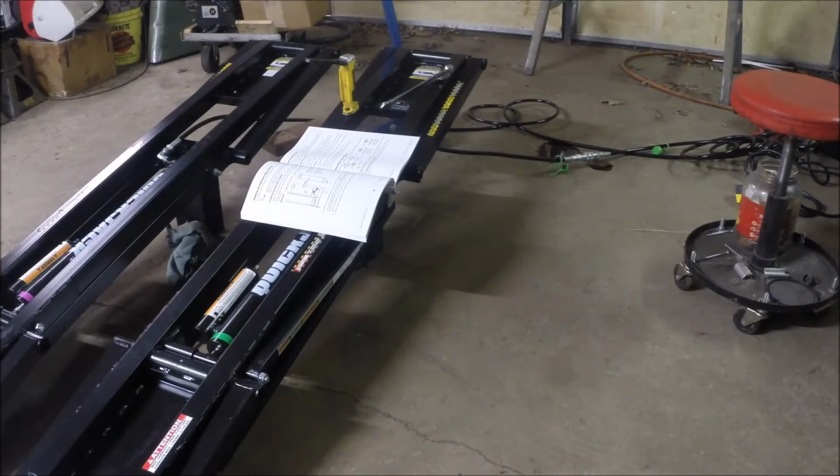I'm not really into this liquid stuff, but you can't use anything that's going to dissolve or come apart and then get into the hydraulic system and monkey everything up. So we're going to have to look at that, see if we can get these leaks cleaned up. And then we've started to bleed the air out of the cylinders. I think we've got most of it, but we still got to go through the process. There's no point in pumping automatic transmission fluid out on the floor and making a mess. So we'll fix the leaks first and then get back to the process.